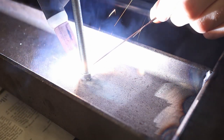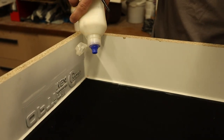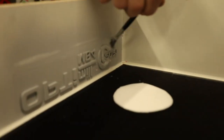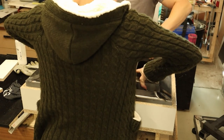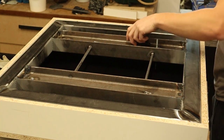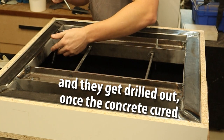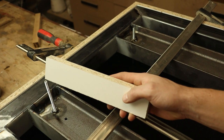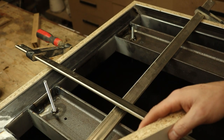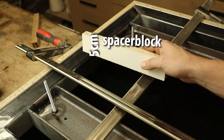These nuts are temporarily tacked in place so the metal frame can rest on the four threaded rods. The black plastic bushings prevent the concrete from sticking to the threaded rods. With these threaded rods I level the whole structure, so I have an even spacing of five centimeters all around.